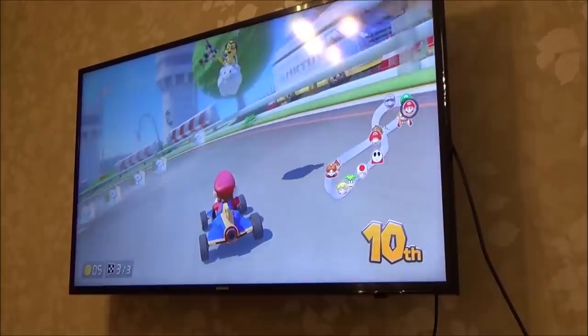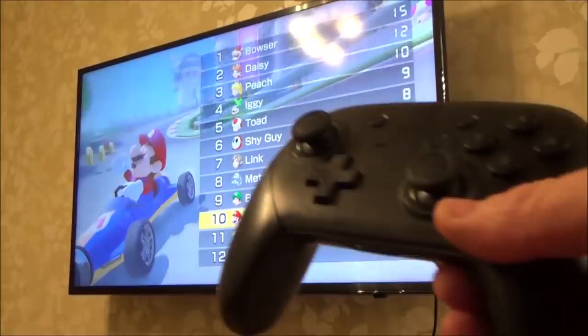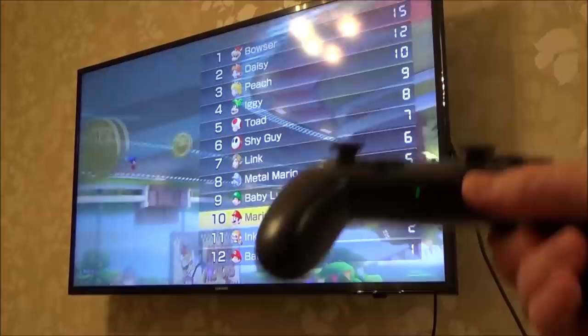As far as I'm concerned, it's great that it's working on the TV, because it can just be a dock switch, you know, for example, just using it with a Pro controller. I didn't bother messing around with the Joy-Con rail connector, because there was no need, because you can just use it with a Pro controller. If you want to charge up your Joy-Cons, you can just charge it up elsewhere. But if I do revisit it, and if I can get the screen working, I would love to have a go at fixing the Joy-Con rail connector as well by heating it up underneath the board, so I don't melt the plastic, because I haven't tried doing that yet, so that would be quite interesting.